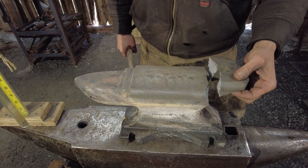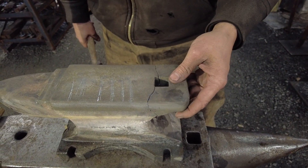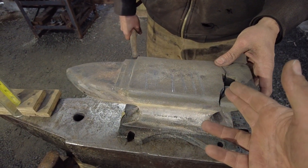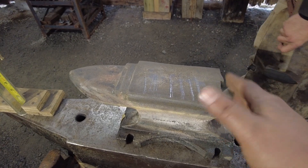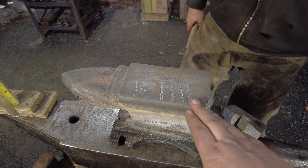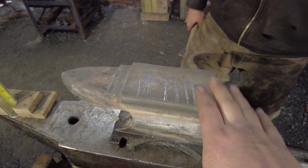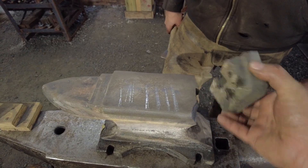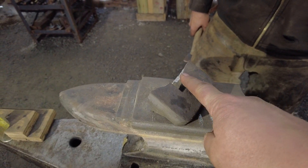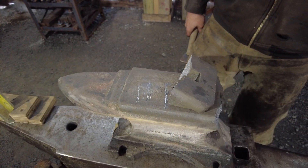No, it is not worth the risk. We gained a bit of surface hardness with quenching, but we had catastrophic failure on the heel. My suggestion to anybody — I've had so many newbies ask 'could I just harden my Harbor Freight anvil?' — the answer is no. If you're just getting into this, you have no business undertaking anything like this, because if it were to fragment out, you could catch a shard in your leg, your face, an eye, or someone else's eye. It's just not worth it.